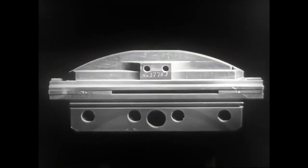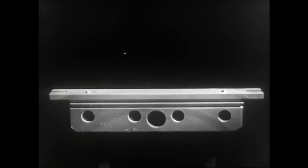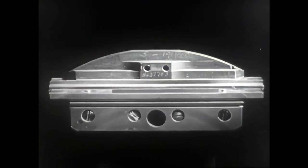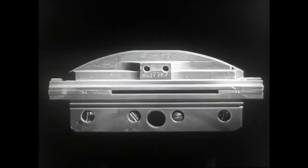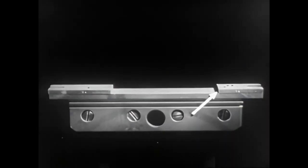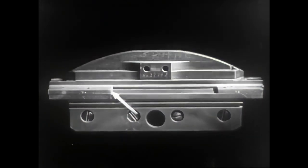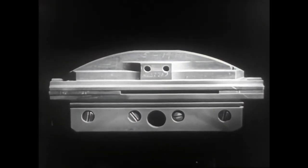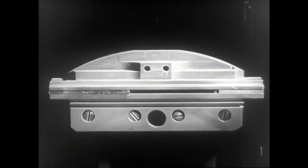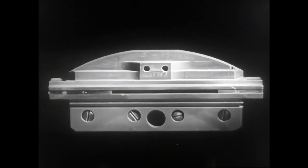The mold is made up of the following parts: the body, fastened to the disc with four screws, the cap. Between the body and the cap there are inserted, depending upon the production needs, the precision liners. Constant length at the right and variable length at the left. The liners determine the length and the thickness of the slug. Therefore, the purpose of the mold, as the word shows, is to establish the dimensions of the lead slug, which may vary in length and in thickness.